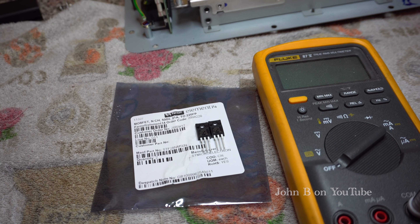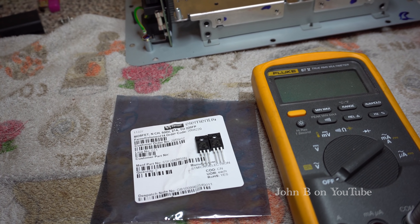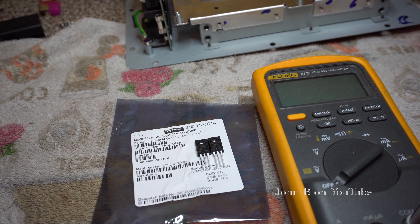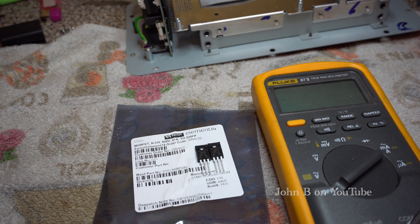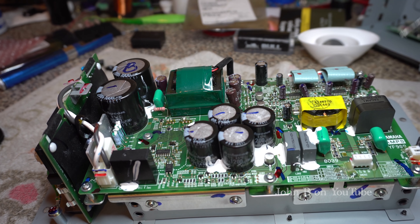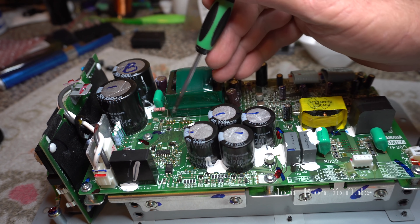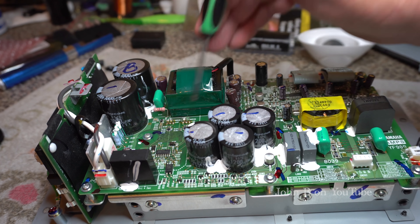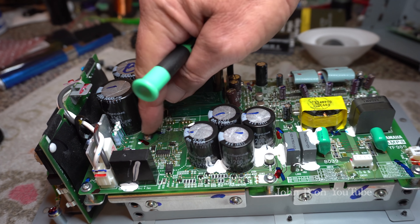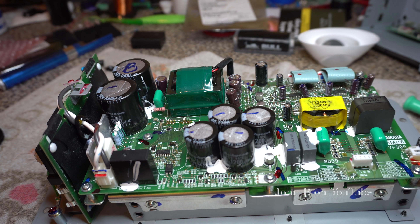So what I'll now do — I'll fit these new FETs and cross my fingers. I'll put it all back together, cross my fingers, hope nothing else explodes, and hope it just turns on and works. So I've screwed the board back down, put the ribbon cables in over here, and then soldered these FET transistors. You can see the flux — I'm not going to take the flux off because it will start washing all this pen mark ink. So all that's left to do —